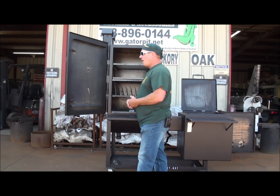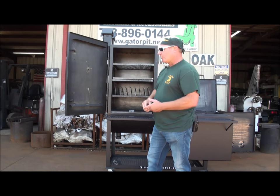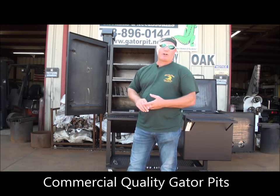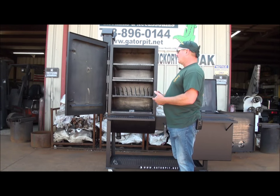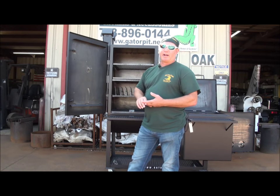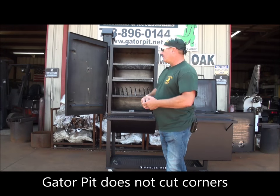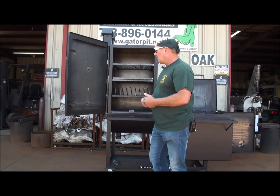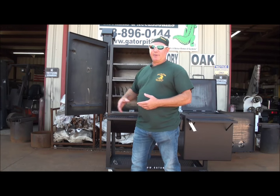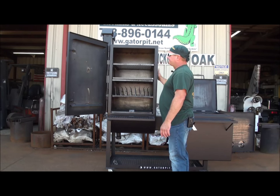These aren't your sheet metal cookers — these are quality, commercial, heavy duty pits. Whether it's in your backyard or in a restaurant, we make them all the same. We don't cut corners. Our log racks are two inch angle log racks, minimum. A lot of the other guys building pits don't use this level of quality in the construction of their cookers. A lot of people are using thinner wall for their uprights and thinner wall in the firebox — maybe a quarter inch wall firebox but then they make the upright out of 10 or 11 gauge, equivalent to eighth inch wall, or as thick as three-sixteenths. Gator Pit is quarter inch minimum up to half inch.